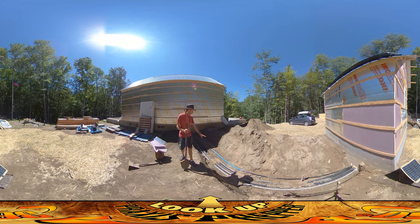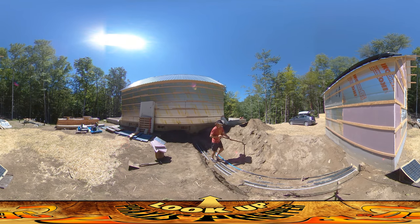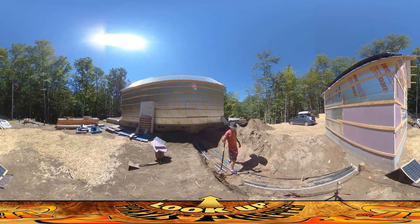By buried, I'm just going to grab some of this pile and start filling in around all these cracks. I like to kind of pack it in as I go so that you get a nice even layer over it, so that when it does end up settling you don't have uneven settling. You're really packing it in with your feet. Also, if you don't pack it in when you put it back down, you're going to end up with way more dirt — there'll be a mound and it'll take like a year for it to really settle down.